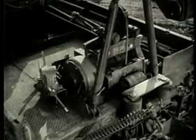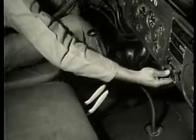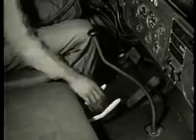To prepare for operation of the rear winch, first set controls in the driver's cab as follows. Set the brakes by depressing the foot pedal and the micro brake lock switch. Shift the transfer case to neutral.